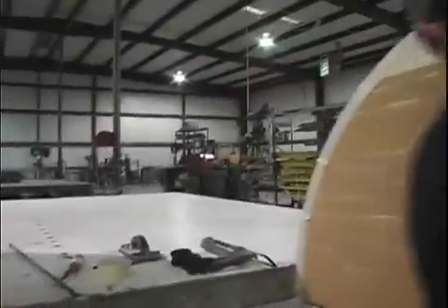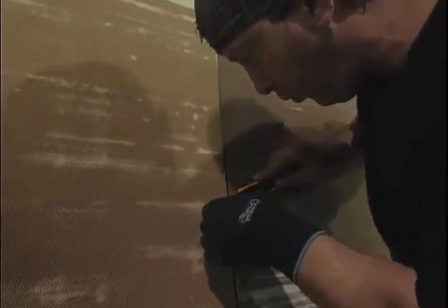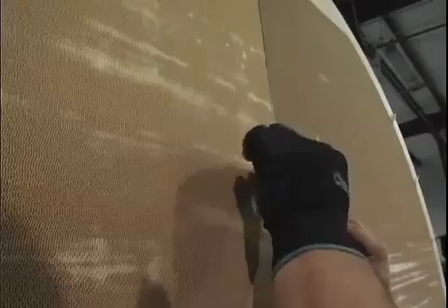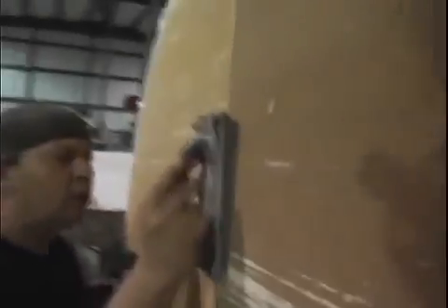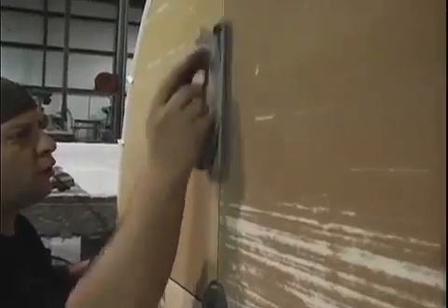We can take either a knife or a keyhole saw to cut whatever excess we can reach. Whatever remains sticking up, we'll get our sanding block and sand it down even with the rest of the face. Make sure that we're good and flush there. Now that the patch is installed, blow it out with compressed air and apply a face coat.